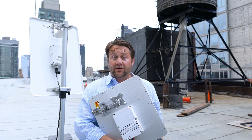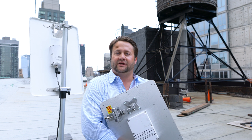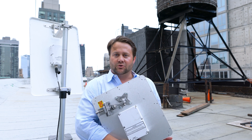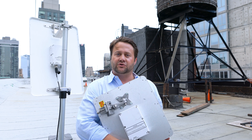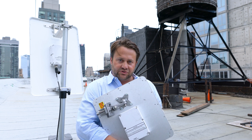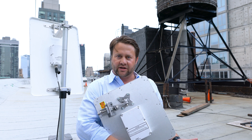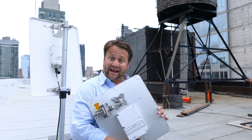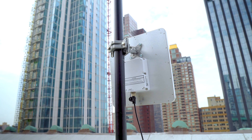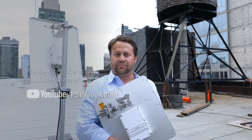These antennas will be paired with our sector antenna — a 3x3 120-degree sector antenna. That's important because we have dismounted MPU5 users that we want connected to the enterprise. By using our sector antennas to give us coverage over a large geographic area, we then connect our panel integrated antennas to create a high-speed backbone, further connecting our disadvantaged MPU5 users to the larger enterprise.